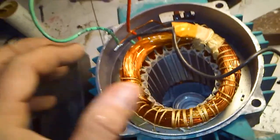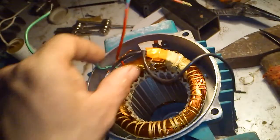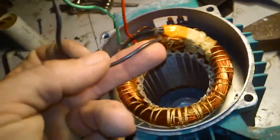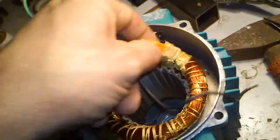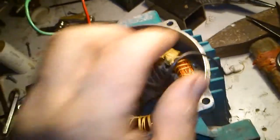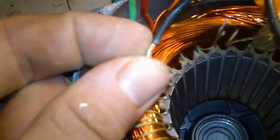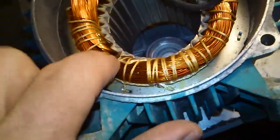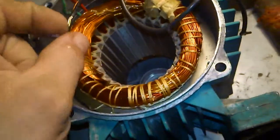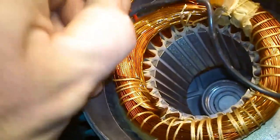So I went to the path I really wanted to avoid — I found the center tab, and it seems to be the simplest solution possible. I didn't find anyone on YouTube actually showing how it may look. As you can see, this motor has a thermal fuse over here, and this goes to the main tab. After that, both coils are connected here — the start coil and the running coil. The running coil is the darker, thicker wire and this is the start coil.